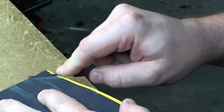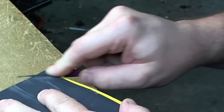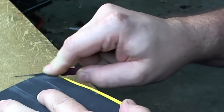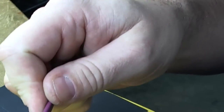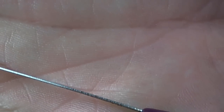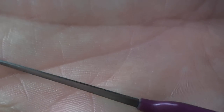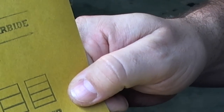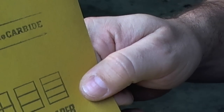And you can hear it, how it's those little bumps on it. Or maybe I'm feeling it, I don't know. But do that until all the, like I said, it's not anywhere near ready yet. But you want all that gone. You want it to be smooth, completely, totally smooth, so you can't feel anything. So do that. Once you get that done, I switch to the 1200 grit sandpaper. Do the same thing. Keep going until you get her as smooth as you can.